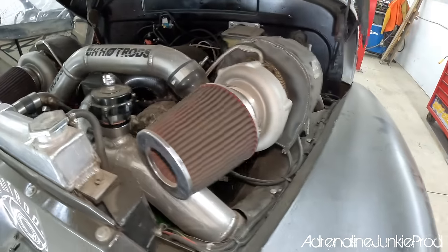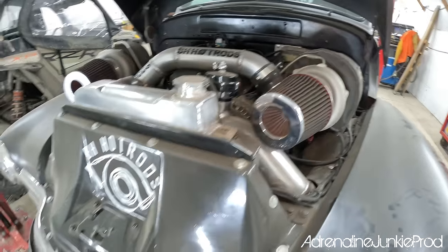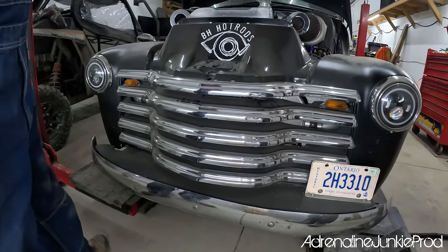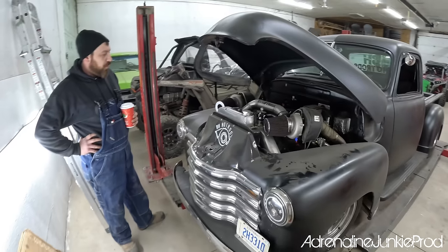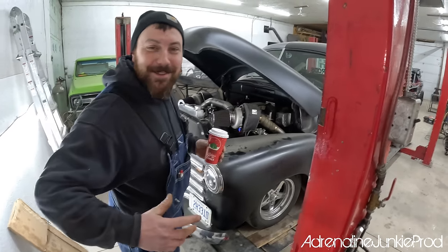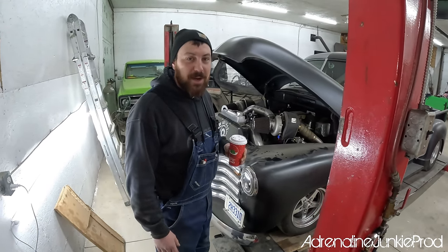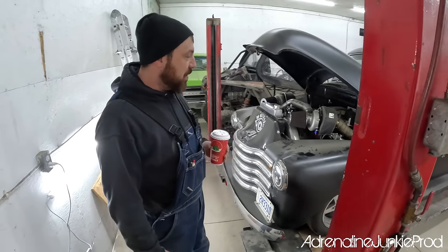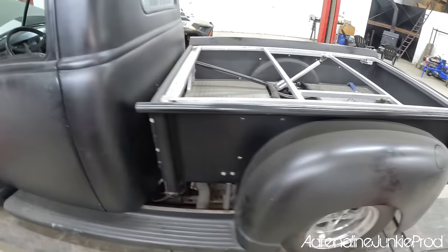This thing's sweet. What size are those turbos? Those are 68s. Yeah, they're billet turbos. And then it's got a forged 408 stroker, air-to-air intercooler, and it runs on 91 and meth. What's it put to the wheels, roughly? So we're on 19 pounds of boost. I shouldn't really be saying this on camera for the no prep guys, but whatever, we haven't cranked it up yet. We made 830 at the wheels on 19 pounds, 91 and meth with a mild octane booster. So we're hoping in the new year, we want to lay down 1,000 at the wheels and probably be around 22, 24 pounds of boost.